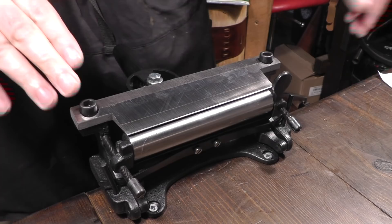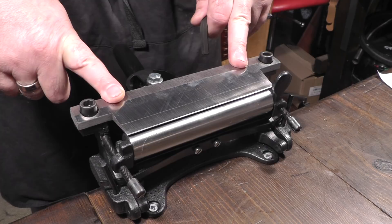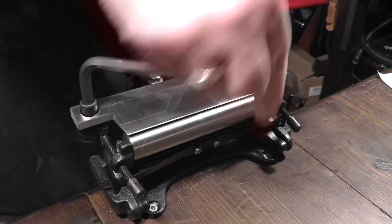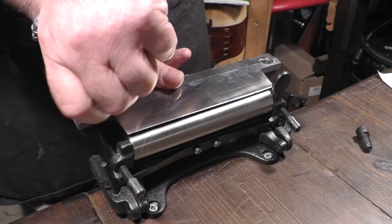The front section is no different to the 86. The 86A comes with the adjustable handle. We have sitting on top the 6-inch hollow ground inlaid tungsten steel blade with two very smart blade screws, and I'm using an 8mm hex key - equivalent to 5/16ths in the US - to loosen those, and we can then take those screws out to have a closer look.